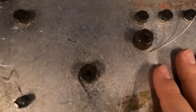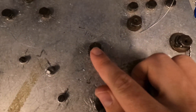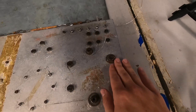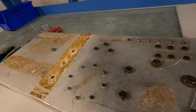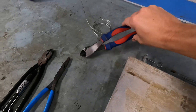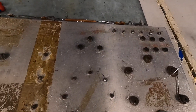For the sake of this demonstration, I'm going to use this bolt and this bolt - the holes are already somewhat square, so that makes it easy. I'm going to be doing this by hand this time, unlike with the pliers like I did in my last video. I do want to mention I am wearing my safety glasses, because I'm using these which turn stainless steel into projectiles. I'm going to be using 032 safety wire and I'm going to be using the cross method.